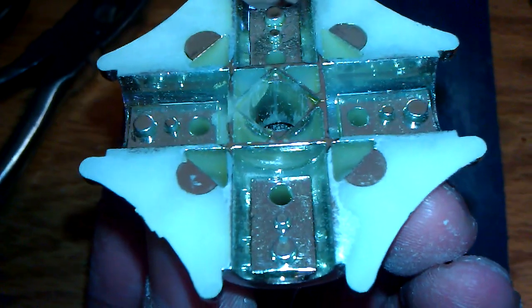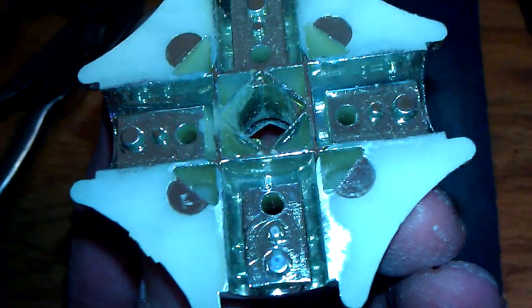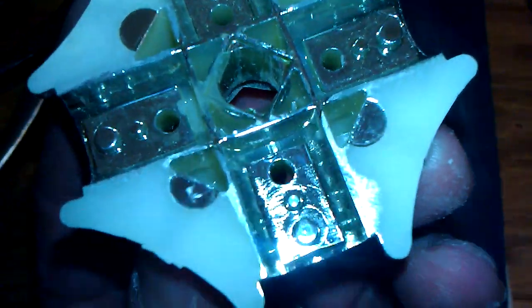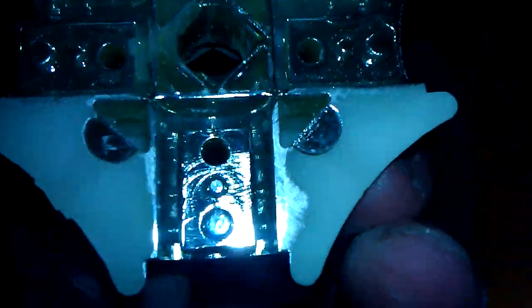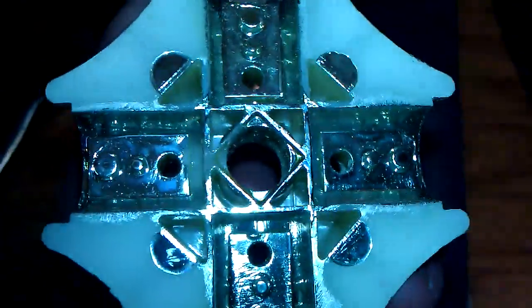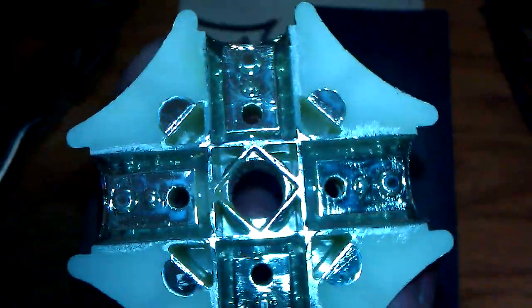My prop was way off. I had two blades that were perfectly in sync with each other, and two blades that were perfectly in sync with each other, but not in sync with the first pair. When I sanded on a very flat surface, I was still seeing chrome on that plastic after sanding it quite a few times. When I still see that chrome paint on there, that means I'm not getting a flush, flat surface.